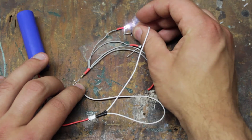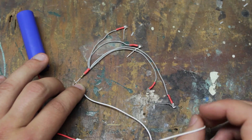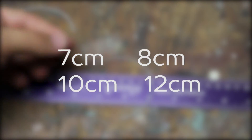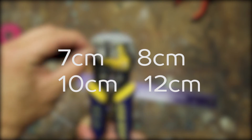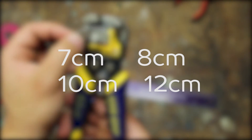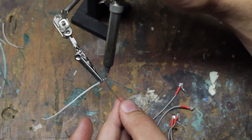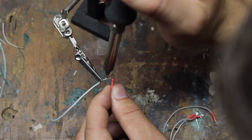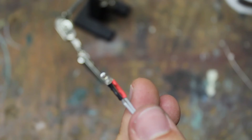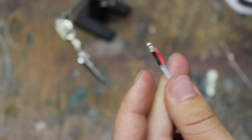If you want, you can test the LEDs with a battery, but there shouldn't be any problems. Now we're going to cut and strip more wire for the negative leads. We need 7 cm, 8 cm, 10 cm, and 12 cm lengths. Cut down the negative lead, tin the wire, attach it to the LED, and cover the connection with heat shrink tubing. Make sure your LED looks correct and repeat this step for the other three wires.